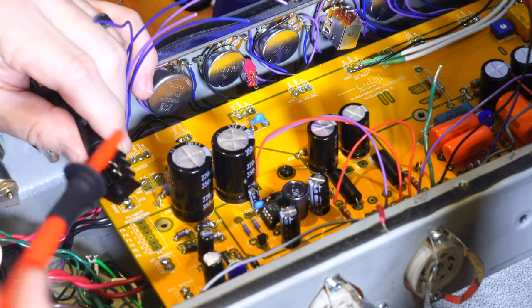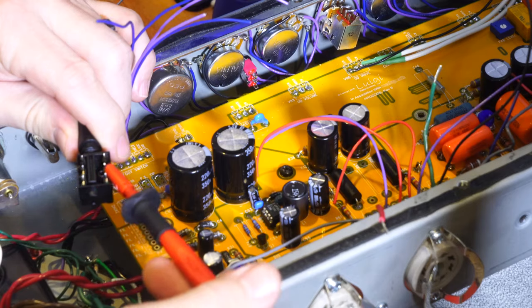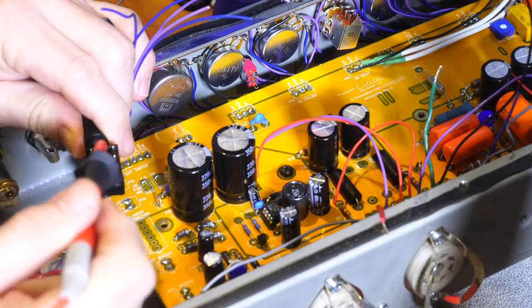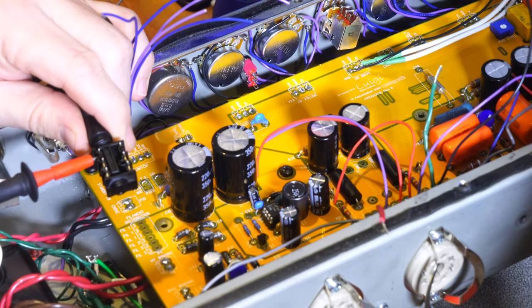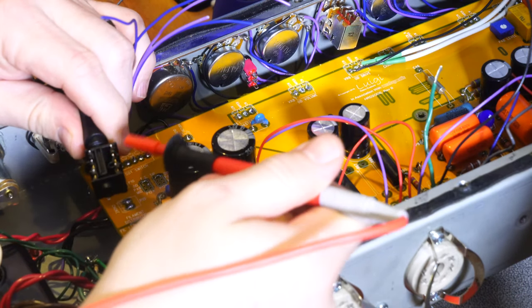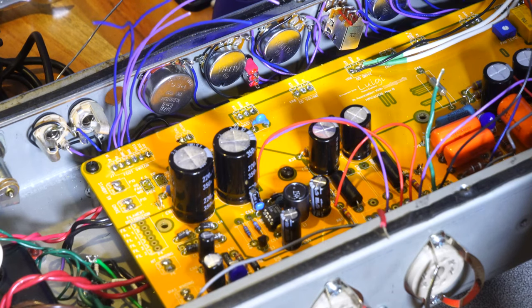So I just explained that to her. The connections that say the regular tip and sleeve just go here, but tip switch and sleeve switch will go on this side. And then we don't need to worry about this switch ground. We don't want to switch ground. So the ground will just connect to this side that's always connected. And that's it. So she's going to go ahead now and wire those up.